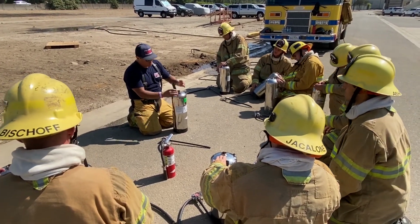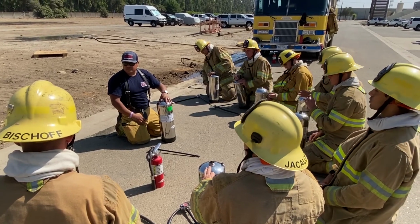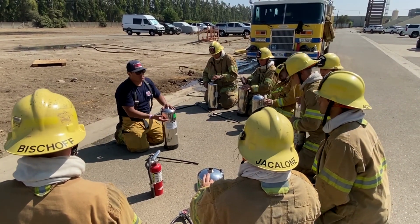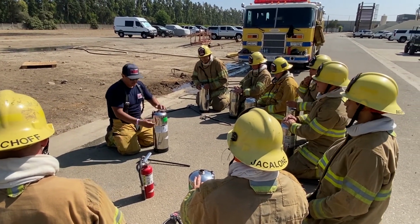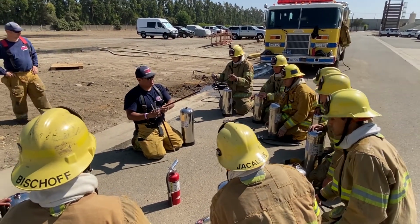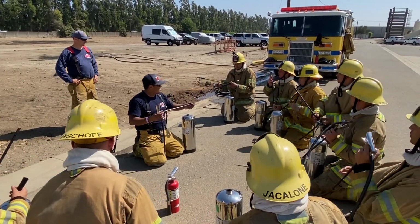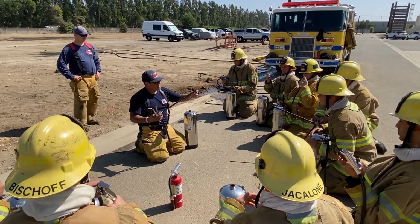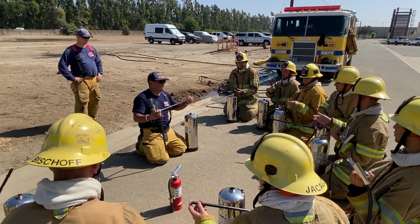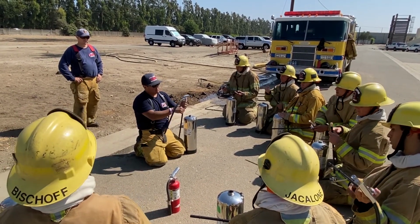When you drop this back in, there should be no water in the front. That makes sense? So that's going to be your water level. We're going to go to the little strainer at the end. This one's built in to this inlet tube. Some of them are attached to it, like that one. Mine's built in. We have a new one that's built in. So that's going to keep rocks, any kind of debris, from coming inside the inlet tube or suction tube top.